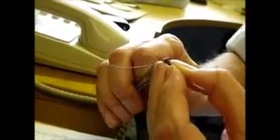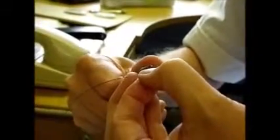Now if I make this side, what should I do? Make this side a bit short, so that there's a bit of a step in it now. Yeah. Now that's not the end of the world, because it's quite easy to open up the curve on the short side and then tighten up the curve on the long side, and that will gradually bring it down. So what was not the right height is now much closer to being the right height. It's not terribly beautiful, but